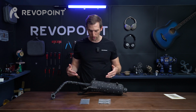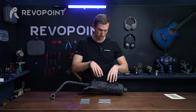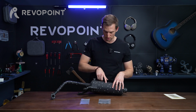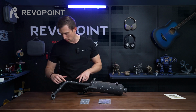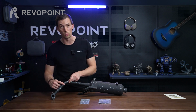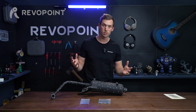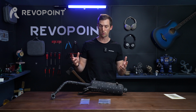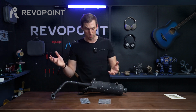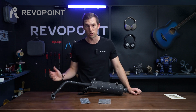Here I have this muffler. I actually combined them in this situation because you have this part here where it's a little bit more wide and big. I used the 6mm there. Also on the pipe itself, I added some 6mm, but then also added the smaller ones. But then you're going to have items like when we scanned the helicopter that we just had to place the 6mm all over it. But then you're going to have something very small, featureless.